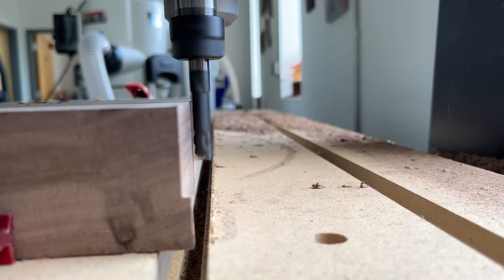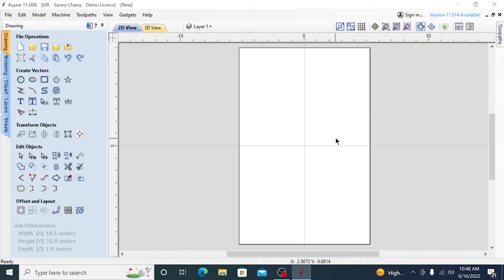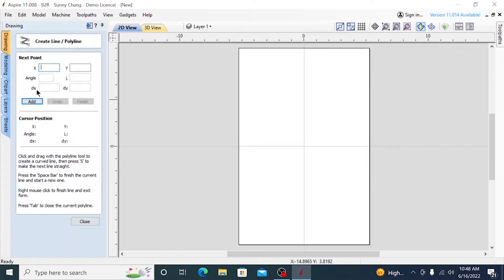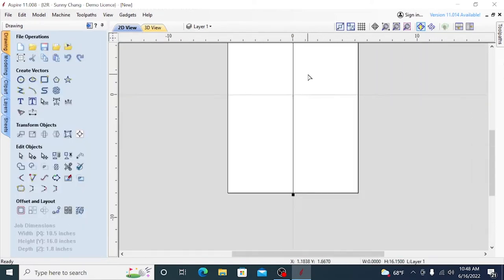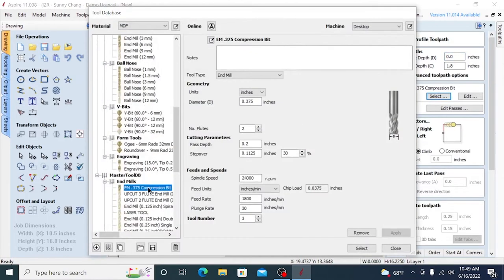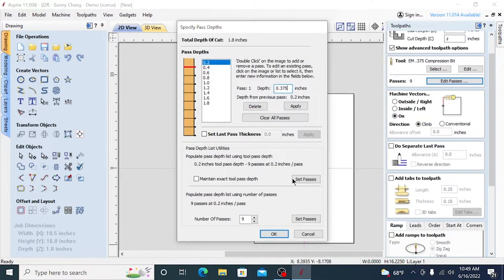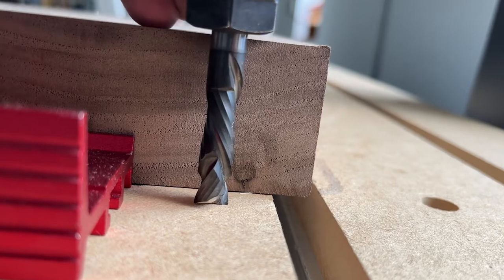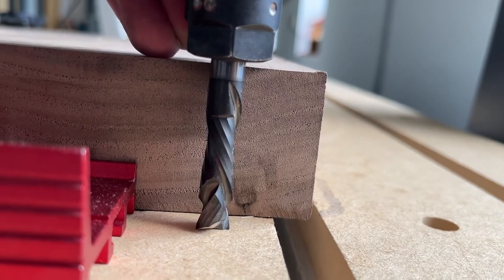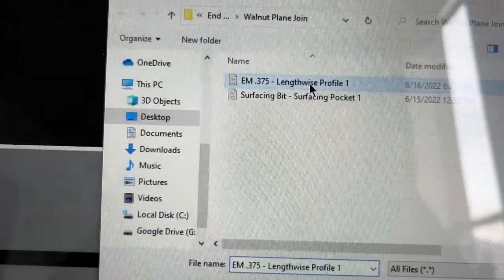Next step is straightening and squaring the sides. For this you need a different toolpath, but it's even simpler than the last one. Open your VCarve project again and just draw a line down the middle of your longest axis. Extend it slightly to make sure your bit will clear the dimension of your material. In my case it's the Y-axis, but you may have oriented your material differently. Next, create a profile toolpath along your vector, set the cut depth to the same amount as your material thickness, choose on the line, and select an end mill as your tool. Keep in mind that your tool will have to clear the height of the board, so choose a bit that you know is going to be long enough. Export that toolpath and load it into UCCNC.